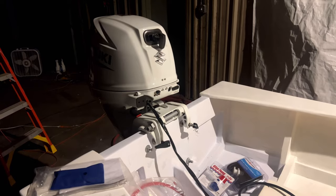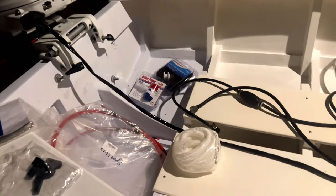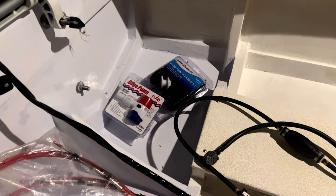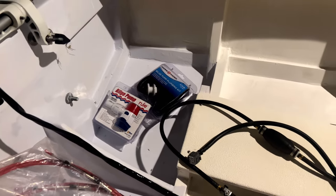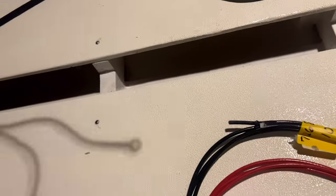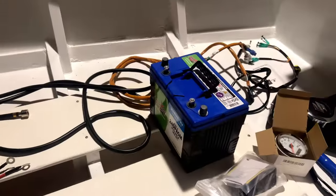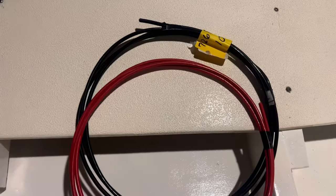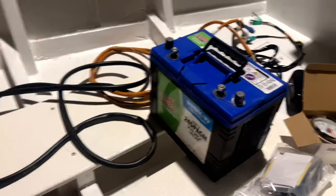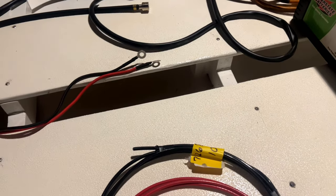We're just about there. All right, now that we've got our Suzuki outboard mounted and bolted and all sealed up nicely, we've got a whole bunch of other stuff we gotta add to the boat here. Back here is going to be a bilge pump kit in case we get swamped or in case I'm too fat and the boat sinks. We've got a fuel line and a wiring harness to go to the engine. Legitimately, with enough slack in it, it only goes that far. And that's where the battery is going to be sitting in the center console. We've got lines for the trolling motor. I'm going to use chunks of those, splice them into the battery line, give me a little extension there, and seal everything up real nice and make it corrosion proof and all that sort of thing.